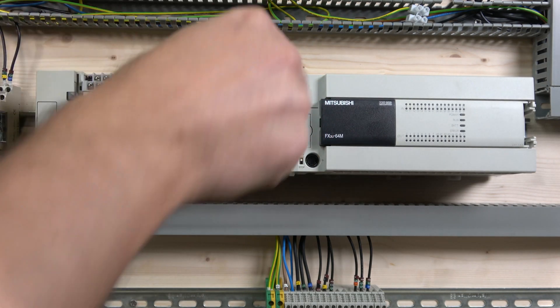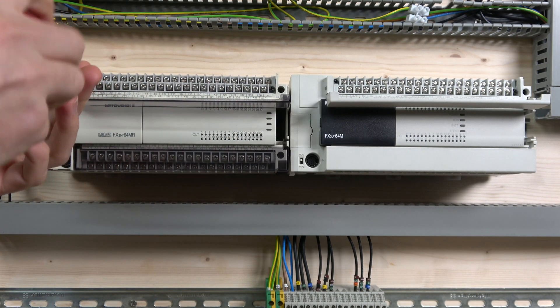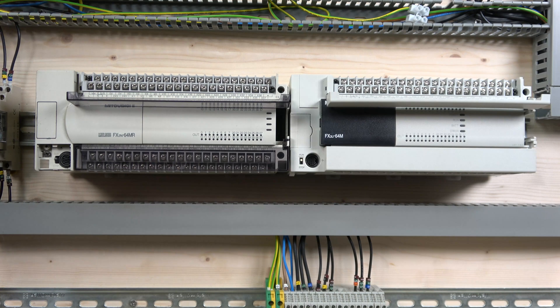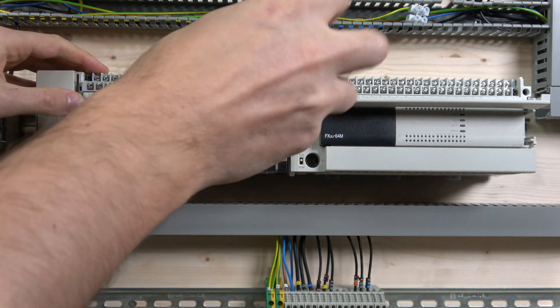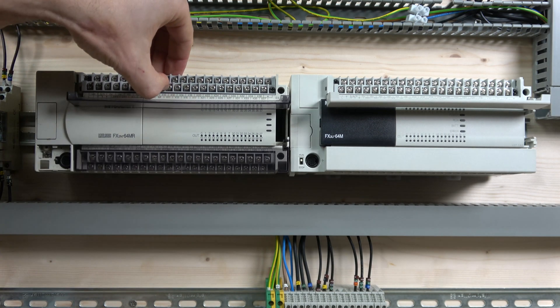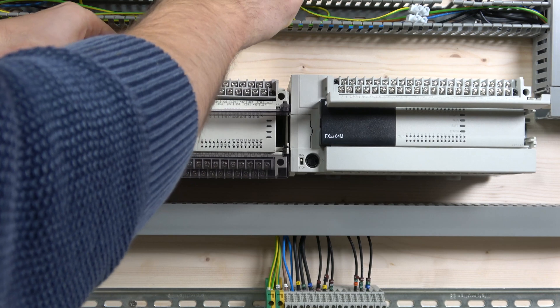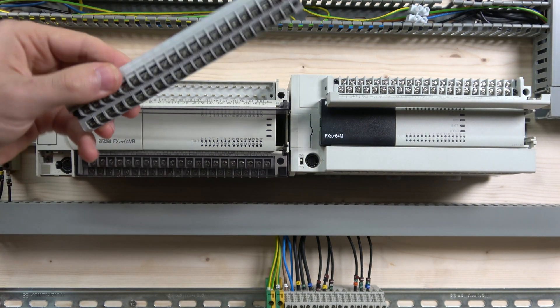The hard way is to de-wire all the cables and move them across onto the FX3U PLC. The easy way: you can see there are two screws — one here and one here — which will remove the terminal blocks. So unscrew these and the block will start slowly moving away from its pins. Once you unscrew it you will hear a little click, meaning you're there, and then just give it a little help to remove it. As you can see, the block has completely come off.